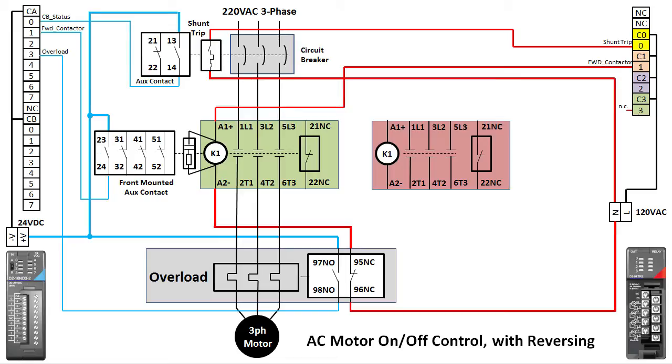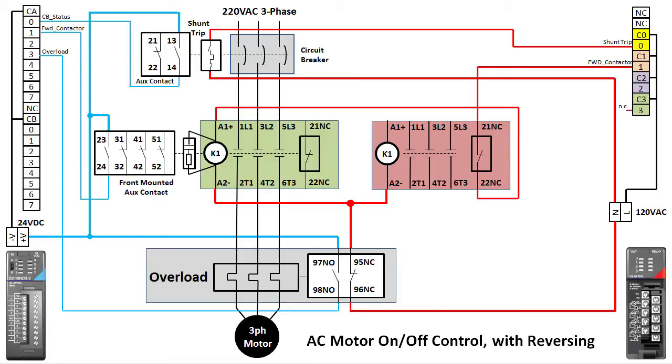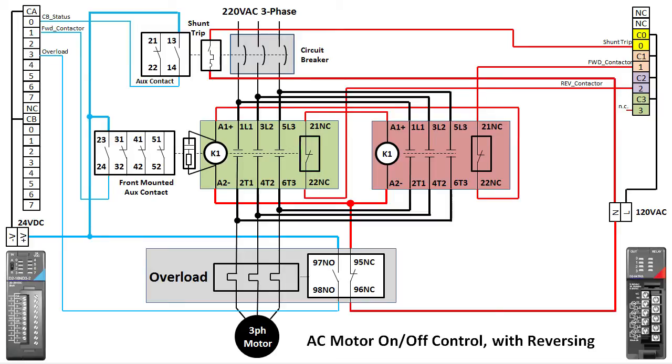To fix that, we modify the control wiring a little bit. Instead of controlling the forward contactor directly, we run the control wire through the aux contact on the reversing contactor, so if the reversing contactor is engaged there's no way the forward contactor can be turned on. We do the same thing for the reverse contactor — run its control wire through the forward contactor's aux contact, so if the forward contactor is engaged there is no way the reverse contactor can be turned on. Finally, we run a copy of the power lines through the second contactor, taking care to cross one set of wires to get the reversing action. The good news is this wiring is already done for you in these reversing kits — just plug them in.